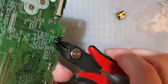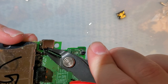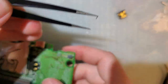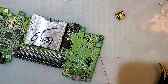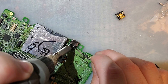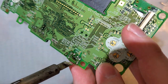Now it's important that these stupid things be trimmed flush on both sides. And that you actually get shit like this out of there. Or else you end up with the best kind of problem, an intermittent one. Nice. Now we can flip it back over, and I believe these line up enough that you're supposed to solder